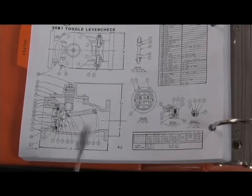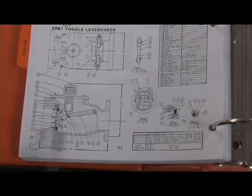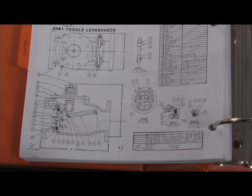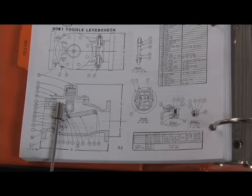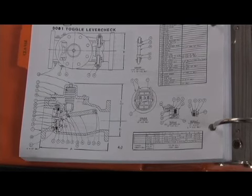And here's a view from the top, and here's a cutaway view of the side. The cover came off from the top. The spring was loaded from the very center. It utilized a toggle design where there was a spindle here and a spindle there that it rotated on. The check assembly would be in the water passageway, and as the water demand came, it pivoted straight up, compressing that check spring into the cover.